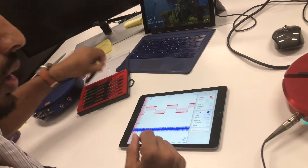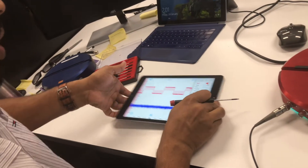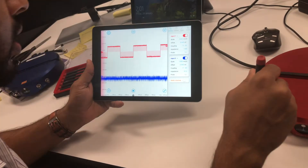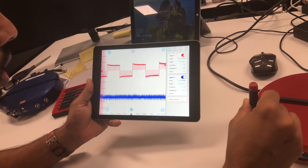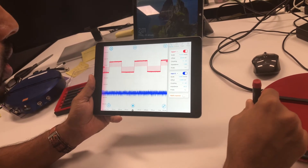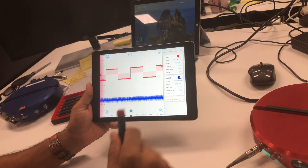What we will do is adjust your probe and see how it reacts to the square wave. As you can see, as I adjust the screw the waves change, so you'd like to adjust it to something like that — and that's pretty much it.